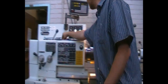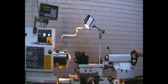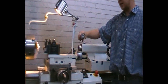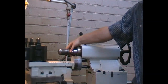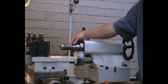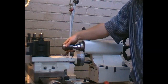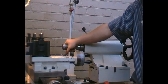If we look where we want to drill, we can see this drill which is a normal drilling head attachment. You insert it in — one way it won't fit, so keep rotating it to where it wants to go inwards. Because it's tapered, it locks itself into position. Move it out slightly and just a little bit of ramming gets it in solidly.